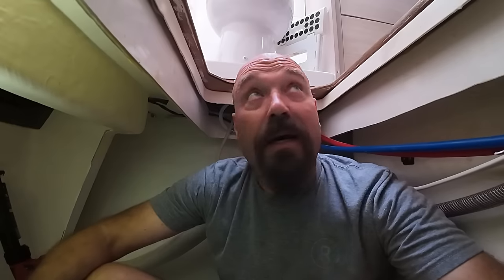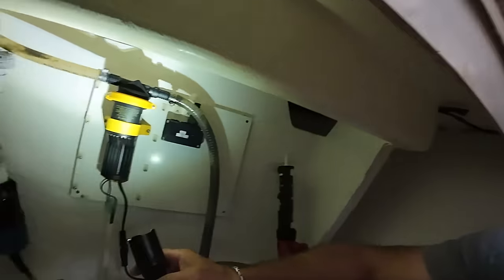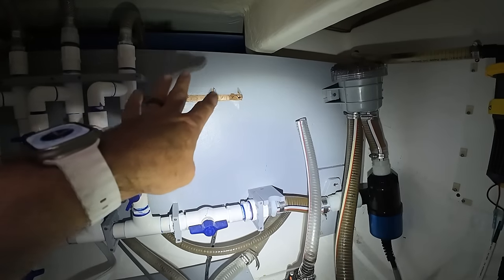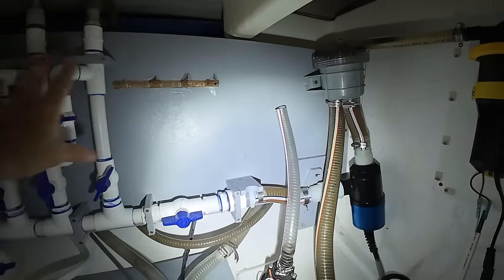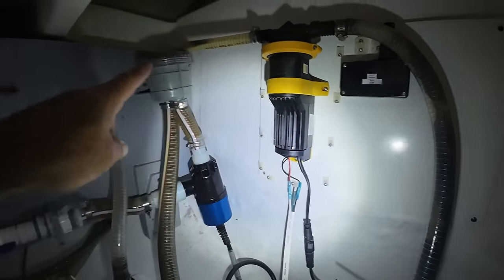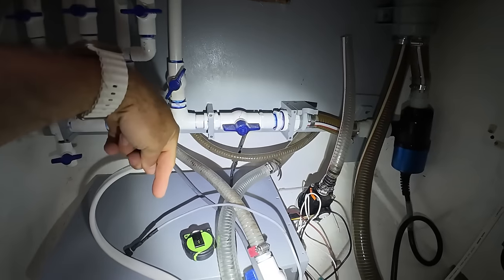This is the exciting part. By the time I got everything handled today it's now just after lunch, and it's a warm day. I have to completely shut down and drain the entire air conditioning system to be able to put this new manifold in, and it's going to get warm. This is the old manifold board — I tried to take this thing apart and it did not work out well, so I'm going to completely remove this. I've made a new board here. The new manifold is going over here, the shower sump is going over here, the sea chest is going here, and I'm going to be using all new hoses during this. Kim, I need you to shut down all of the air conditioning and turn off the pump.